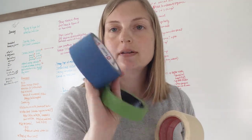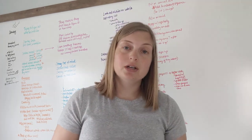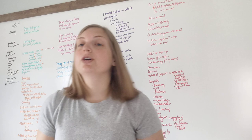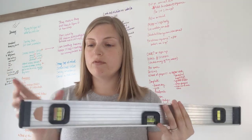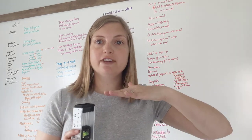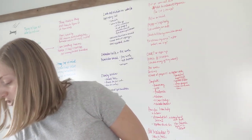You'll need a tape measure, a pencil, and a hammer to hammer in the anchors. You'll also need tape — I prefer painter's tape, the thicker kind — you want tape that comes off without leaving residue, so don't use duct tape or packaging tape. You'll want a level, ideally one of the longer ones. You could also use a laser level or a leveling chalk string. A little bit off will look a lot off when it's carried out over eight feet, so be diligent in marking the lines.